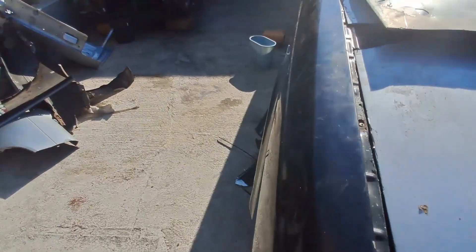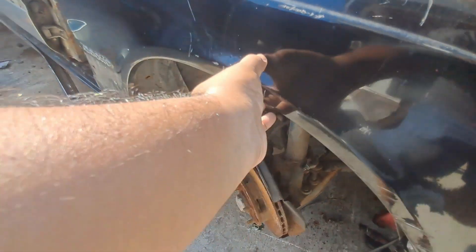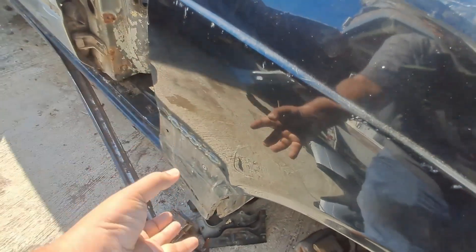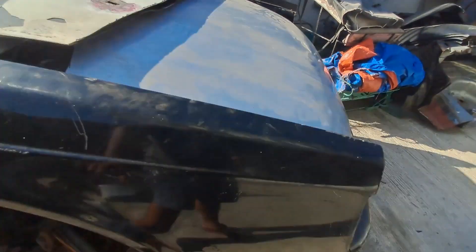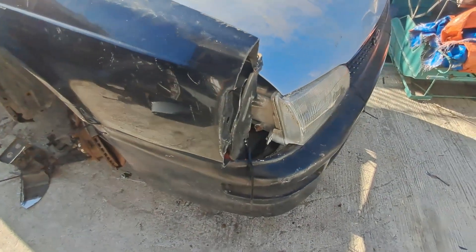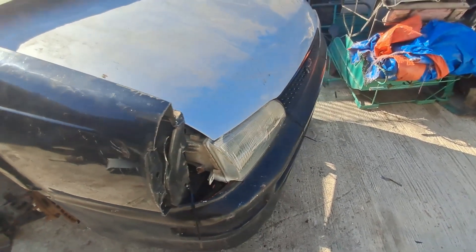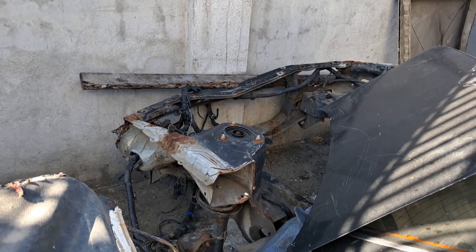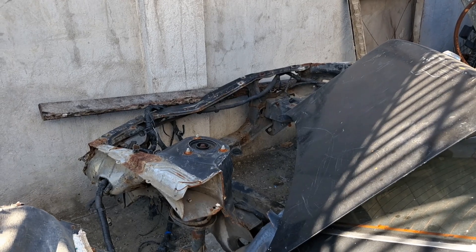These fenders are just a base — the stock fenders of the Mazda 929, Kia Potentia. We want to retain the fender flare portion and a bunch of the bottom part. The top portion I'm assuming will completely go away; we'll be grafting parts of the Toyota fender so that the signal lights can be mounted there. We'll have to create brackets for the headlights so they are properly situated. We also have a junk radiator support here from the Corolla that we might repurpose.